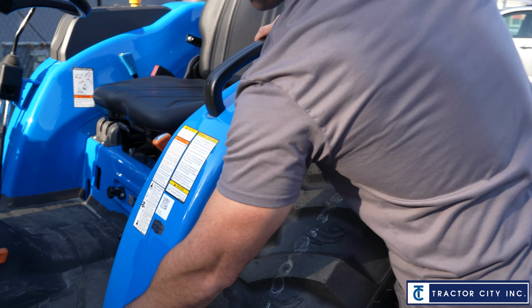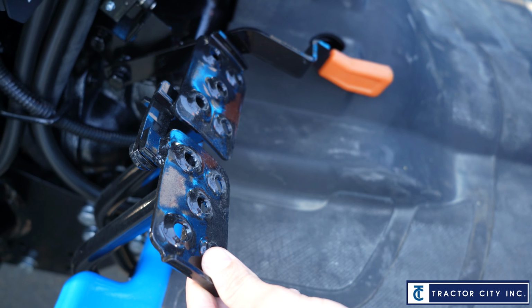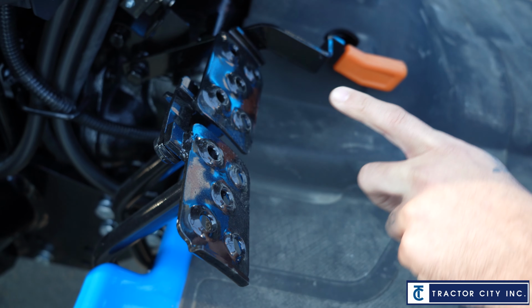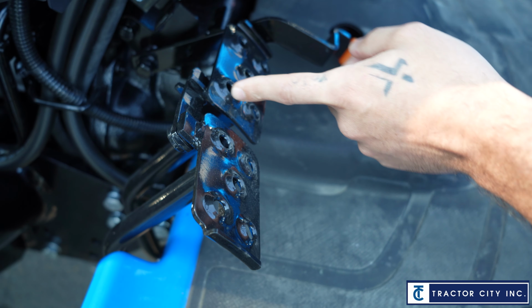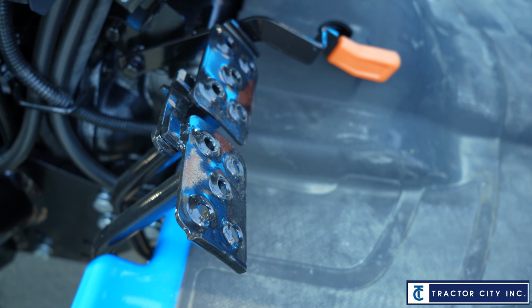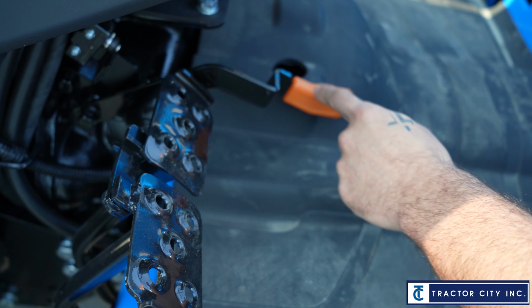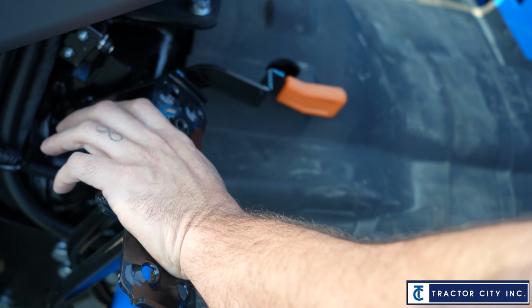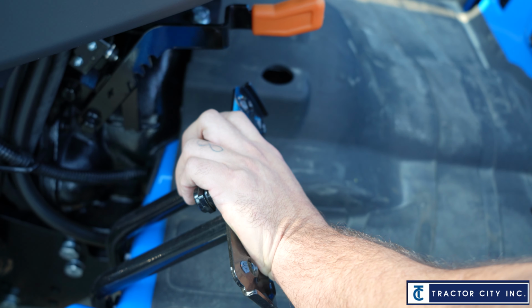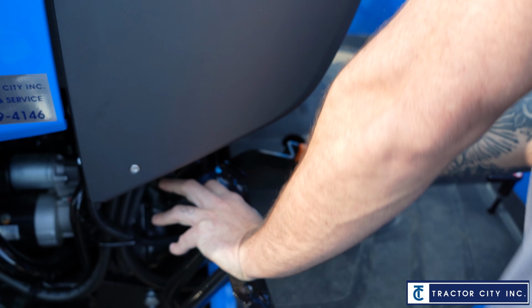Same thing on this footrest here. On the other side, we showed the pedals. On this side, just going to be your brake. There's 2 pedals because you can lock in one side or the other. And then there's a little latch that locks them both in, so it's just going to be together like a car would be, right? And then the e-brake on this is actually a hand lever, and that's locked in right now. To release it, I just press down on the pedals and it releases. Okay? And then obviously that beeping's telling you, hey, turn your e-brake on.